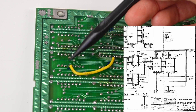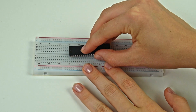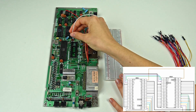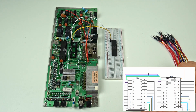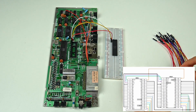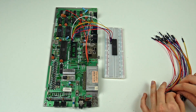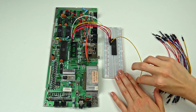I'll use this 8500, a breadboard, and some cables. As mentioned before, the 8501 and the 6510 are very similar, but shifted by one, so I connect the pins following this project scheme that I'll leave in the video description below. The project is for the 6510, but the 8500 can also be used. Then I checked one by one that the pins were positioned correctly and were well inserted, following a scheme that I made.